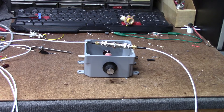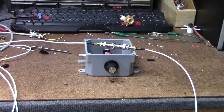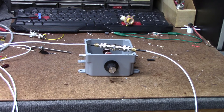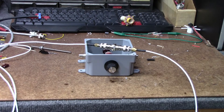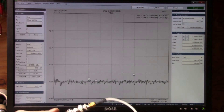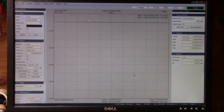This is where we'll be doing our testing. I'm going to put the display on the main screen so you can see what it looks like. I'll be adjusting the core to move the notch around, and I have two markers up on screen at the extremes of where this filter tunes. We'll look at it across 30 MHz and then across 5 MHz. First, the baseline measurement shows down 70 dB of noise, and we have to calibrate by putting a BNC connector in — that line should level off at the top. OK, that's calibrated. Now let's put the filter in.